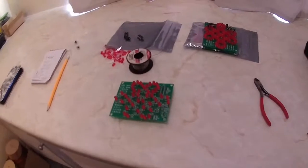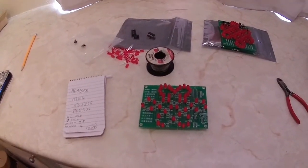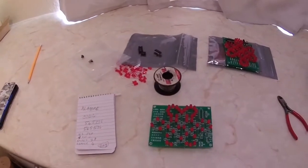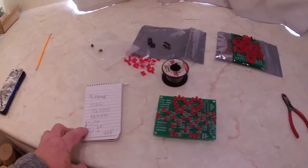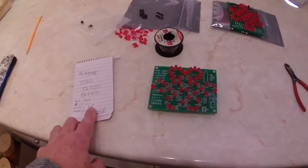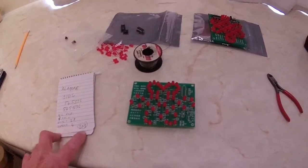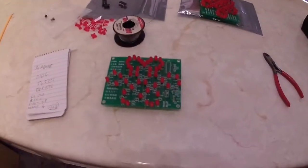To give you an indication of how much soldering is needed on this light display: for just the red LED lights there are 162 hand-soldering joints to be made. There are nine soldering joints for the switches involved with this board, 28 hand-soldering joints for the socket, and four soldering joints for what's called a printed circuit board header connection. So in total there are 203 hand-soldering joints to be done on this kit.